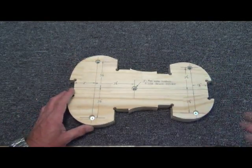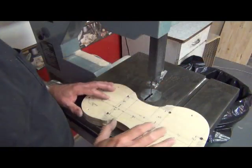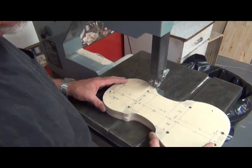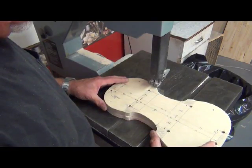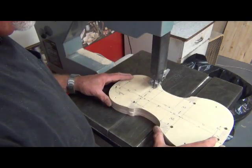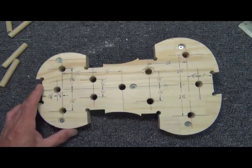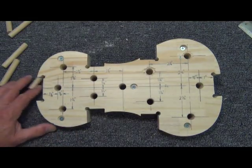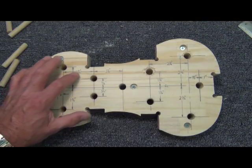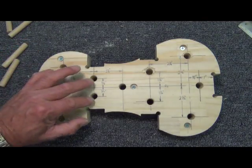The top and bottom are held together with five number 10 screws. I've already drilled my holes that are just for bandsaw clearance, basically. And I'm sawing it all out in one together. This is a series of half-inch diameter holes for the dowels that you're going to use when you're clamping the frame together. As you put each bout in, you put quite a bit of pressure on these dowels.